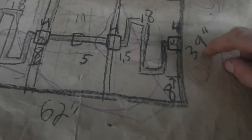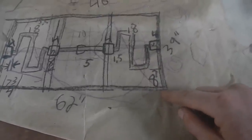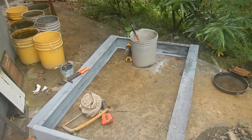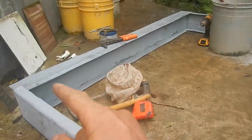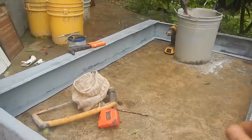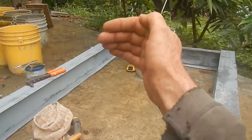Clear again. All right, what's next? Okay, 39 noodle units long, two pieces. I should actually make them a tiny bit short because they're gonna connect into here, so this will have a little bit of thickness. So, short 39. Oh, rivets, how I love thee. Oh, so beautiful. Look at those little guys. Nice work. And I did put one rivet in each corner, on the top and the bottom. Then I measured across this way and across this way to make sure those two measurements are the same, which means it's square, well, rectangle, before I put the second rivets in all the joints. So hopefully that's locked pretty 90 degrees-alized.